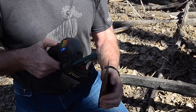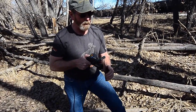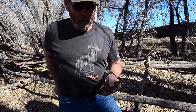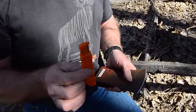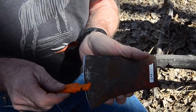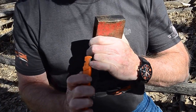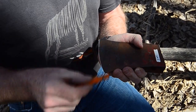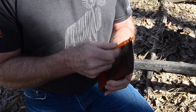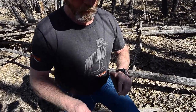It can still use a little more work, so let's keep at it — that's getting better. Do the same thing on this side. Now it's fairly sharp, but I'd take my long handle sharpener, turn it like this, and start brushing the blade right on down, matching the bevel. Turn it about 45 degrees and brush only on the corners — there's a corner, there's a corner, 90-degree corners. Brush the blade, don't dig at it. Roll it over and come back, going both directions with no wasted motion. Then touch it real light and put it back in your pocket.